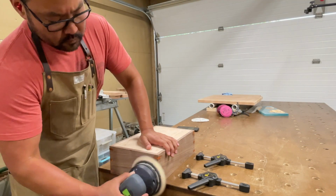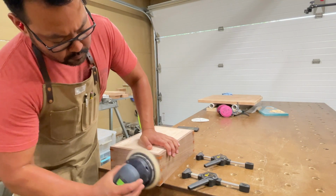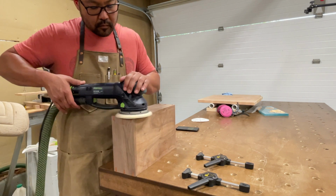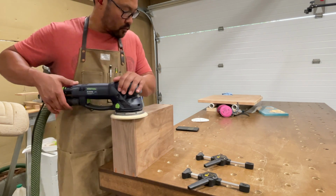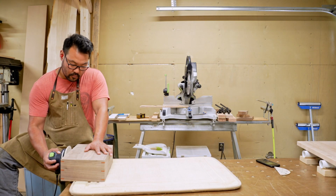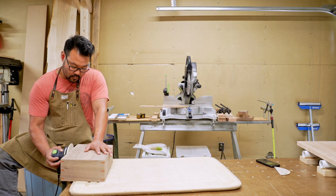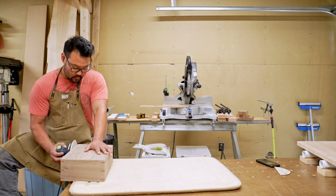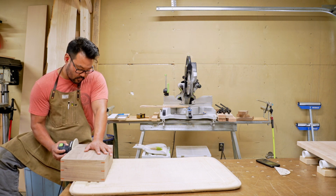This box is coming along pretty nicely now. I'm just cleaning up the splines, but at the same time, I'm gonna sand it to about 220 because I figure with the lid off, it'll be harder to sand evenly, so that's what I'm doing in preparation for the lid cutoff. I know this may seem like a ridiculously awesome power stance, but honestly my back was really hurting and this was the form that I needed to get through the sanding.